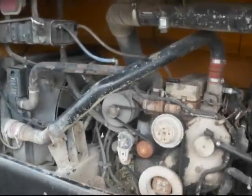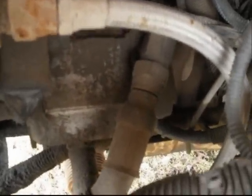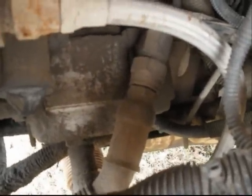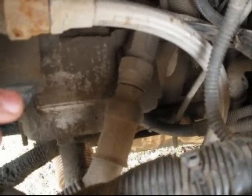This is an explanation of the hydraulic fan drive system on a Bluebird All-American. This is the side of the motor, and this is the air compressor. Bolted behind that is the power steering pump. It makes pressure for the hydraulic fan drive system and the power steering system. Built-in is a priority divider valve that distributes the pressure between the two.